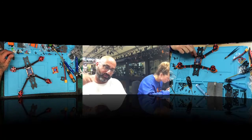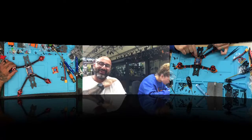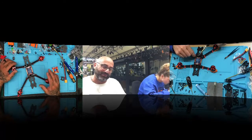And I was like, man, you know what? I couldn't solder. I sucked. So I was like, well, shit, okay, I can't solder. So I'm going to drill through the pads, and then I'm going to run the wire up, and then I'm going to be able to solder it, right? Awesome. All I didn't think about was the fact that the ground ran through the entire board. So as soon as I did that, I ended up grounding the positive and the ground. I ended up shorting them. And here I go, pow! First one, fire. I'm like, God darn it. And so there went that brilliant idea.